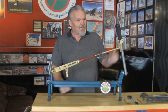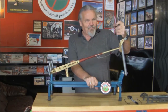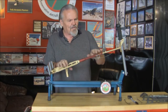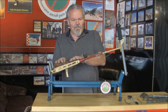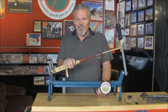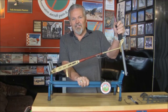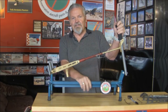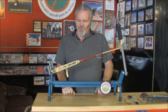Once it's in there, it doesn't matter how strong you are — you're not going to move it more than a tiny bit. You're not going to move it forwards and backwards. The stick is pretty much locked, so the elevator is locked. When you install this, you bring your elevator up to level, then adjust for the length of your stick when the elevator is in the level position. Each airplane is a little different, so we made this pretty adjustable. It locks the ailerons — they will move very, very slightly. If someone pushes on one really, really hard, it will move slightly rather than damage it. The elevator is locked, the rudder pedals are locked — all the controls are locked with one piece.